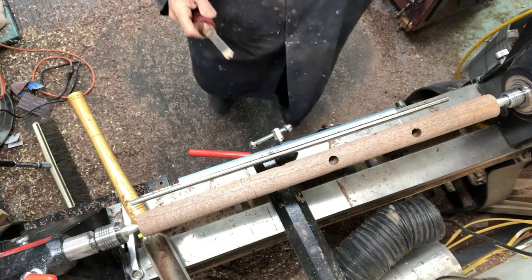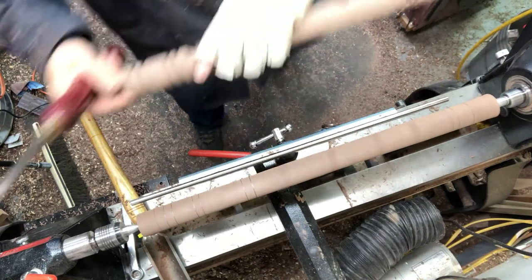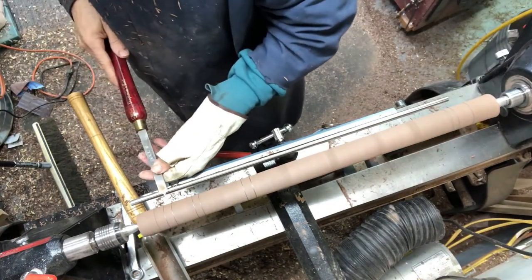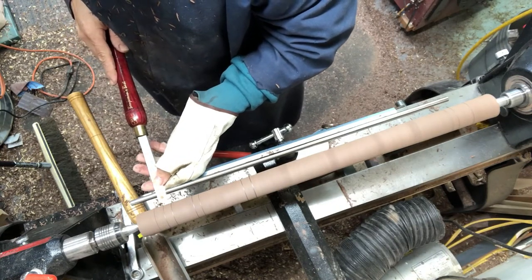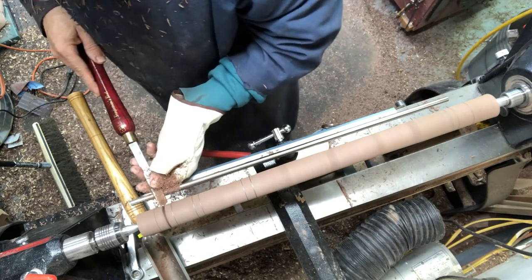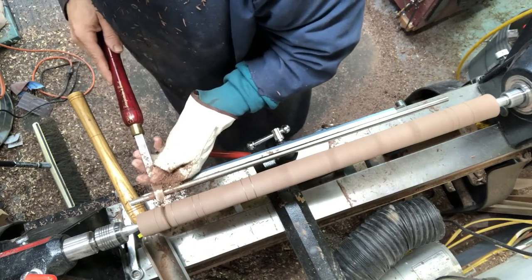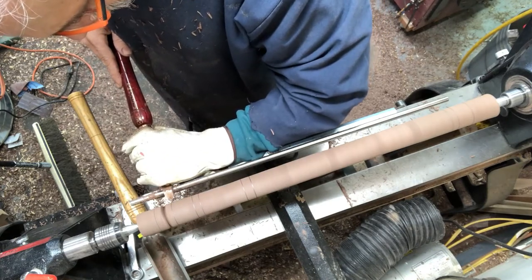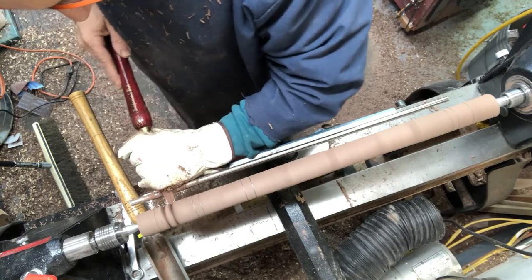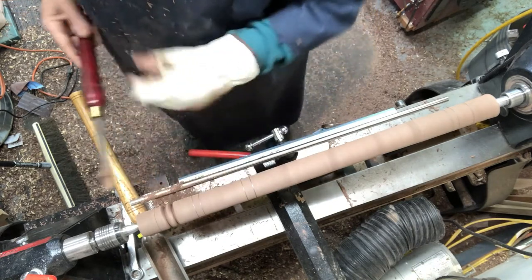This 22-inch tool rest is really handy. Here I'm using the Benjamin Best half-round beading tool. I put my sample up in front of me so I can use it as a reference. The trick I found with the beading tools is you start a little bit below center and move the tool handle down while you're pushing the blade into the wood. You do tend to get a little bit of chatter, and that's one reason I've got a glove on — I'm using my hand to help stabilize the leg, otherwise it's subject to vibration.